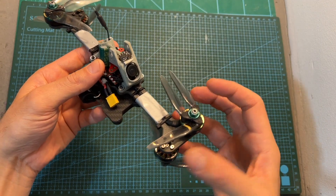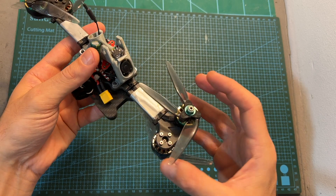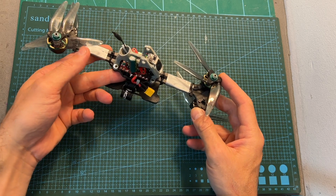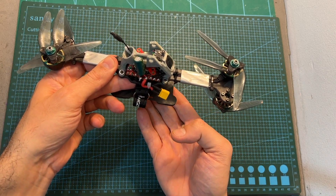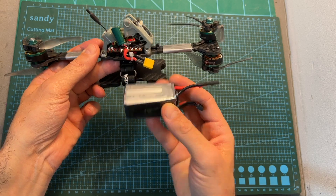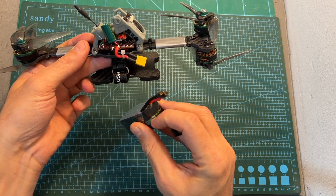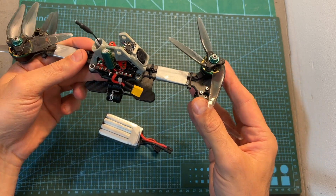For the most interesting question — how does it fly? To my surprise, it is very similar to a traditional quadcopter. I expected the yaw authority to be very minimal, but that wasn't the case. The only downside in my opinion is that it's quite difficult to take off from the floor because the bottom motors are very close to the ground, so you need to raise the motors above it. That's why I used the bottom battery protector. You also need to make sure the battery doesn't come into contact with the propellers — I had two incidents where batteries were nearly destroyed, though luckily they were just scratched.